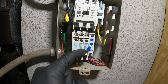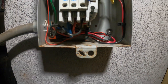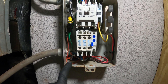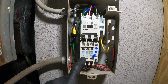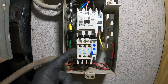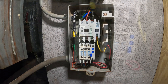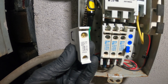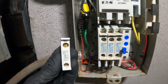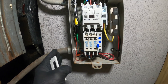For some reason it didn't come with the three heaters — this is a three-phase system. The wiring is nice and neat. I even found some wires in other systems that were just taped off — it was a whole mess. I'm going to show you how to replace these heaters without replacing the whole motor starter. Sometimes they go bad. This is what the overload — some people call them heaters — looks like. It's very simple to change.